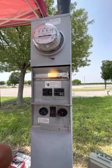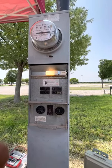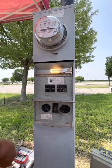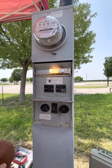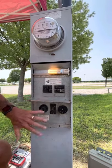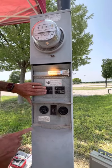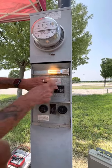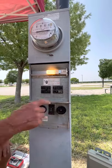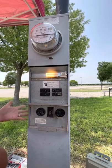I figured in case I ended up in the video, I'd wear my little yellow shirt. So this is a basic class on RV pedestal electrical circuits. This is a very typical pedestal where we have a 50 amp for the 50 amp, 20 for the light and the 20, and 30 for the 30. Some pedestals have the nightlight, some do not.